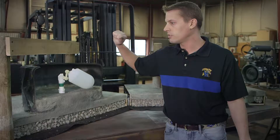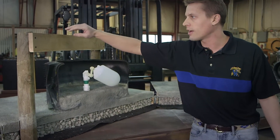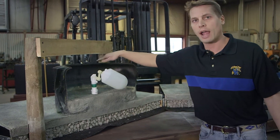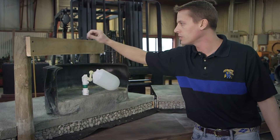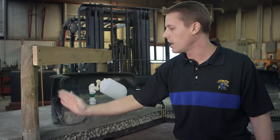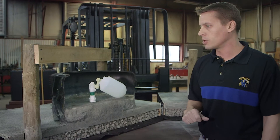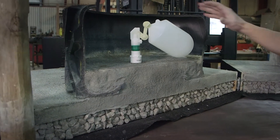One of the best ways to protect the valve and the overflow from your livestock is to put some exclusion fencing over the top of the tank. It'll keep your livestock out of the tire and make sure they're still able to stick their heads under and drink. We've actually mounted a series of three posts set up against the tire, and hopefully that will keep your livestock out of the tire water tank, keep your water clean, and protect your hardware.